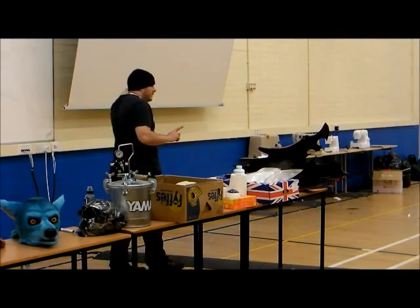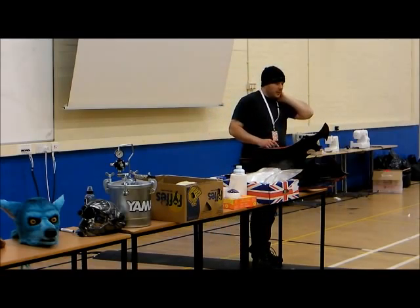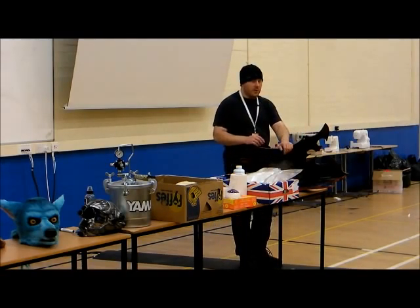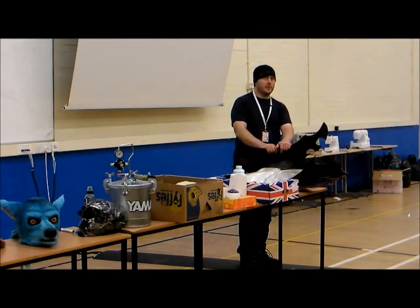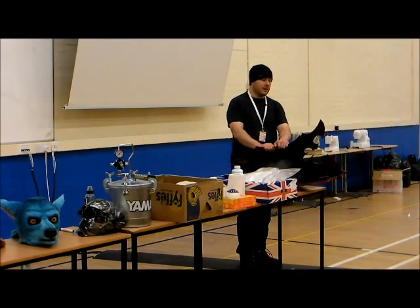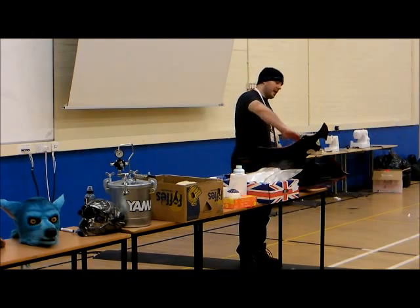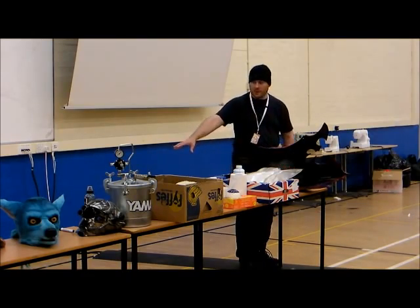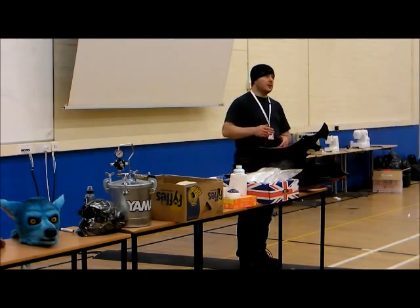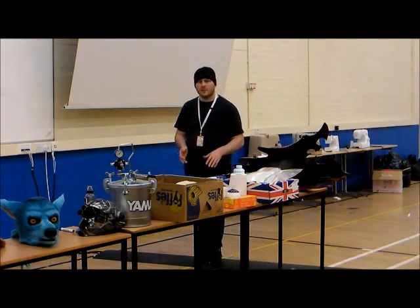To be honest, if I've been stuck, you can actually get stuff called resin reinforced glue. I think it's Bostik that makes it, and the result is actually quite tough. If I couldn't have used fiberglass, I might have made this in casting paper mache. So I'd have a mould still and paper mache into the mould. Some sort of nice thick surface to hide it, probably a little bit of filler, something like that.